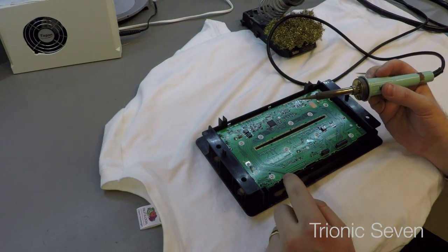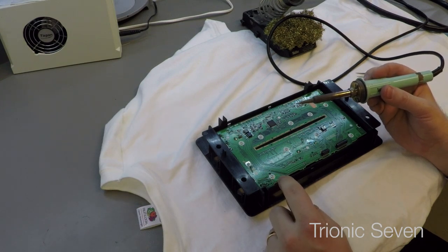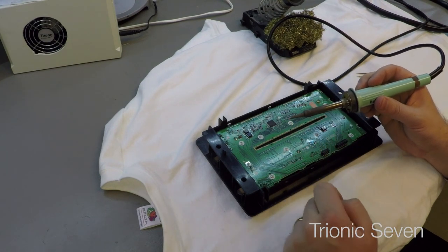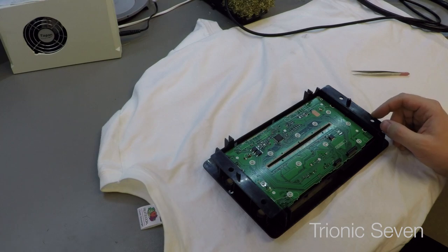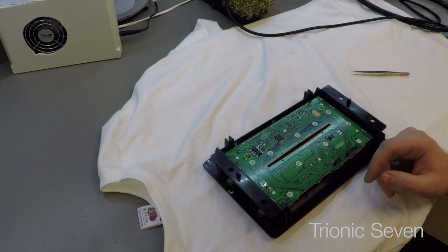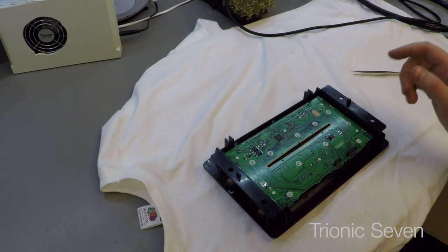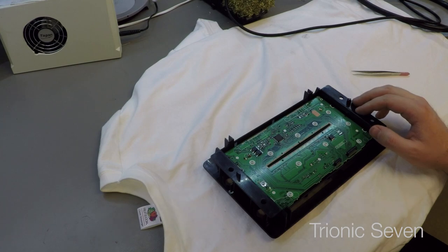Before finishing up, you want to double-check that there's no solder bridge between the two points. If you have a magnifying glass that's great, but a microscope is even better — go ahead and look closely to see there's nothing bridging the connectors. Alright, I'm satisfied. Now my phone and the head unit will talk nicely to each other. We could be finished here — this will work and be compatible with my phone. But again, big thanks to Simon — he found another problem with the Saab head units that we can fix by soldering.